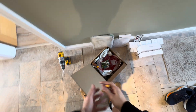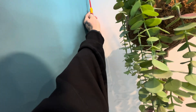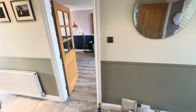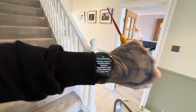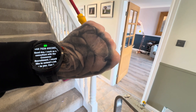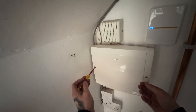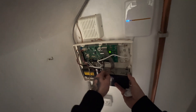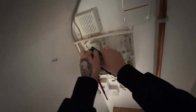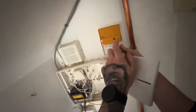The Ajax Hub 2 Plus is a Wi-Fi panel. I nearly accidentally threw my terminal screwdriver away on this one. There was also a hanging basket put up after our original install — otherwise I would never have thought that was a great place to put a PIR. Let's get the Texacom 64 wireless taken down because we're going to be putting our panel in the understairs cupboard.